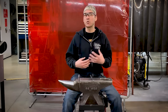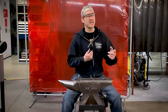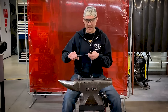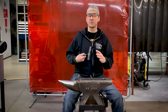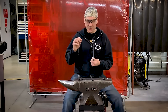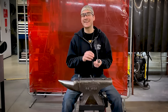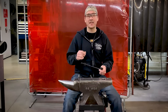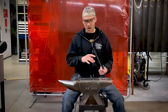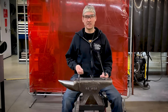4140 is susceptible to heat treating, which means we can make it a little bit harder or a little bit softer through quenching and tempering. Coming back to your chisel — you can't just slam it into the angle grinder, get it red hot, get a nice edge on it, and then use it again. What you're doing is actually softening the material. We can re-harden it and then soften it just a little so it's harder than the material but won't crack when we hit it. In this video I want to show you what happens when we quench a material quickly and then go right to using it.